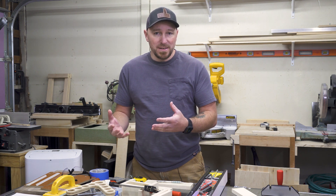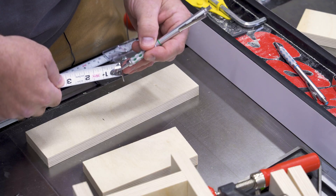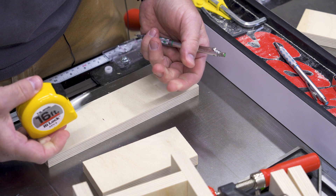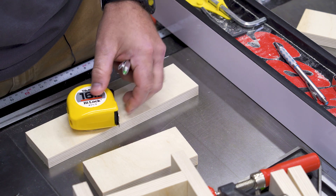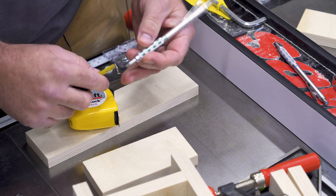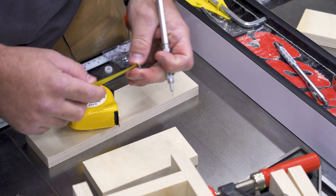There are a lot of things that can alter how this works, like an inexpensive tape measure versus one that's more robust and well built. Over time, as your tape goes in and out and you hook it on things over and over again, the end of the tape will actually get stretched a little bit. Also, the rivets that hold the hook to the tape will start to wear the metal out and it'll get stretched over time. That's why I always recommend not letting your tape slam back in all the time. You might notice on this one there's a little bounce — that's because there's actually a shock absorber right here, and that helps take away some of the bounce. If you have one without that shock absorber, it's going to slam and also bend the hook over time, giving you an inaccurate reading either way.